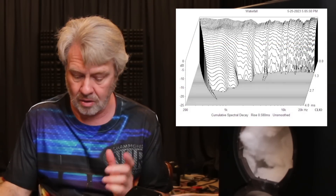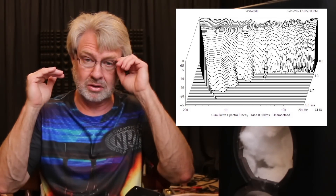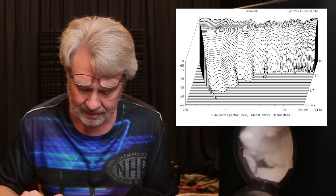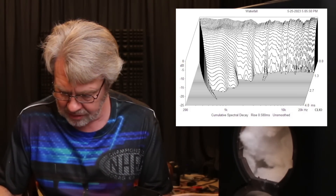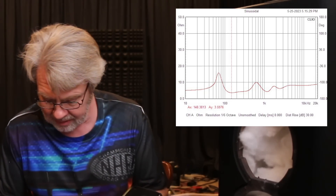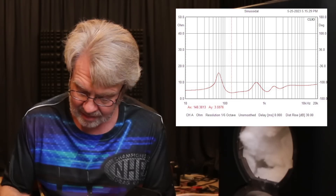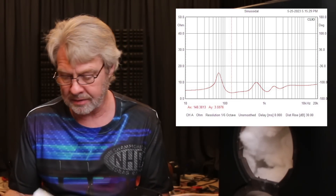The spectral decay on the whole thing looks clean. As I mentioned before, at the very first part of the woofer's response you can see it takes a little longer to bleed off some of that energy — it's holding it just a little bit — but it's bleeding it off really cleanly with no issues in the spectral decay. Looking at the impedance curve, it's also fairly even and dips to about 3.6 ohms at around 150 Hz. The rest is a pretty easy load. All that looks great.